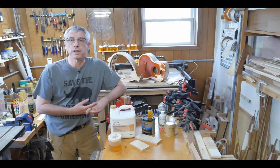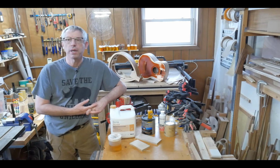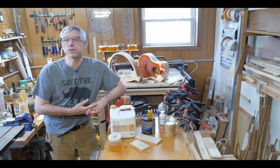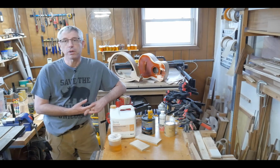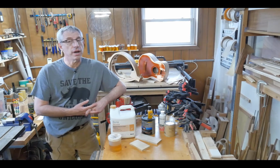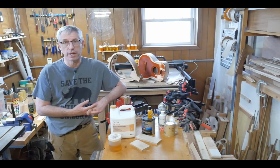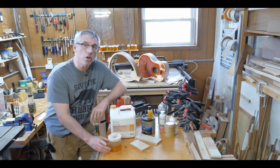The other no chemistry finish that you see a lot is lacquer. Now, it's nitrocellulose, usually, dissolved in this just toxic brew of all kinds of chemicals that form lacquer thinner. So lacquer's been around for a long time, works fine. The only hitch is it's not always terribly easy to apply, and it's not safe for closed spaces. You need a spray booth, or you need to do this outside. I would never spray lacquer in this little room. So that's the no chemistry stuff.